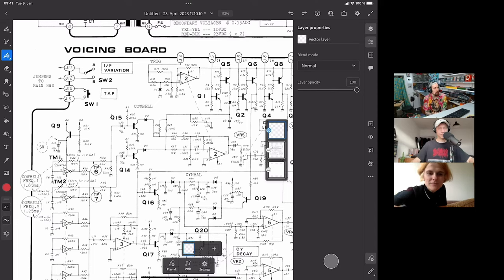Yeah. But so, do you know this Logic Noise articles from Hackaday? Yes. So there's a schematic for a cowbell, mixing gates through XOR gates, and then using a simple transistor VCA as well, without the op amp at the end. But it's a similar circuit. It's just adding XOR gates. Yes. Actually, we talked about this last time.